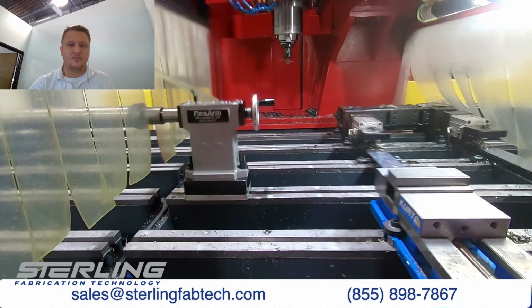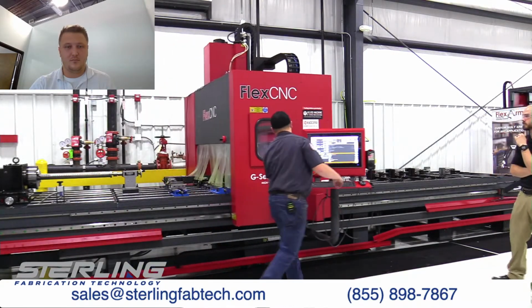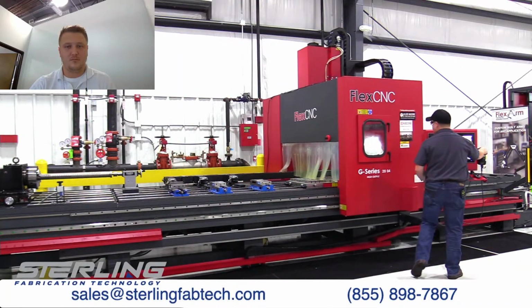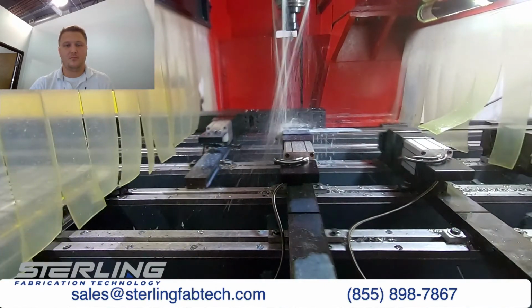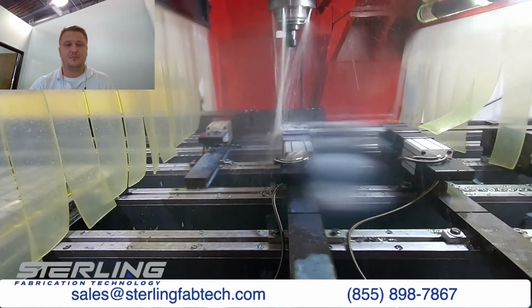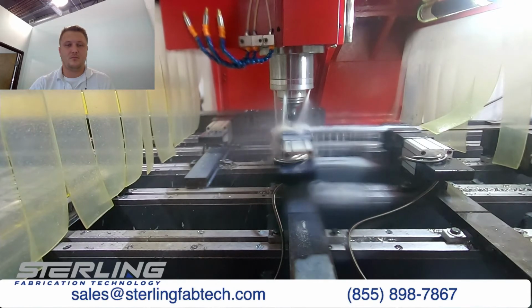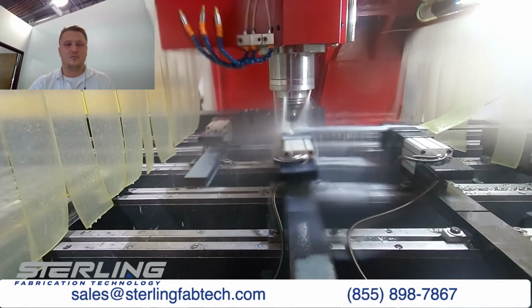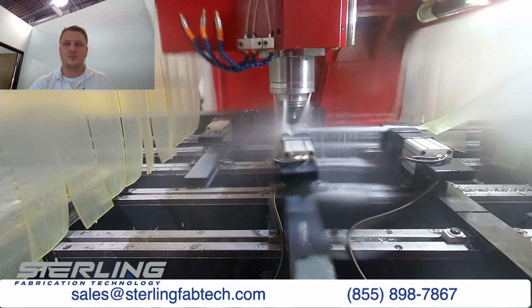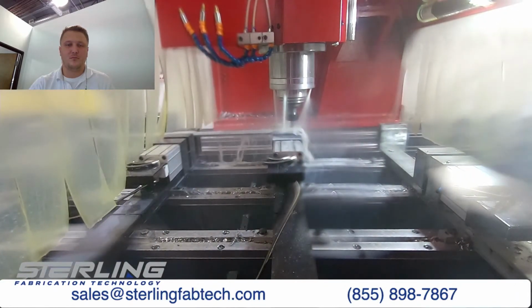Yeah, there's a lot that's involved. I'll start from the beginning. You can't run a part unless you have a program. So the first thing is getting a program, which requires either that I as a programmer draw the model up in Mastercam, which I can, or you'll have engineers creating a solid model for your programmers to program off of. Then it's taking that solid model into Mastercam, and basically it's me telling the machine: what am I going to be doing, where am I doing it, and what kind of tooling am I going to be using?